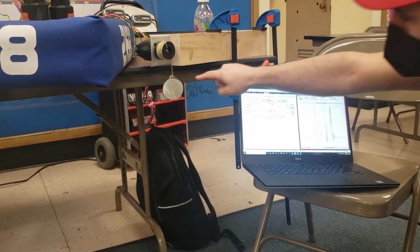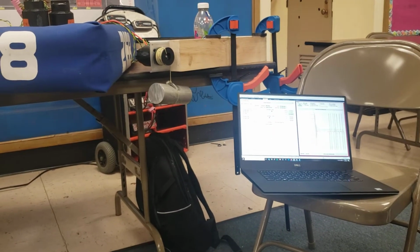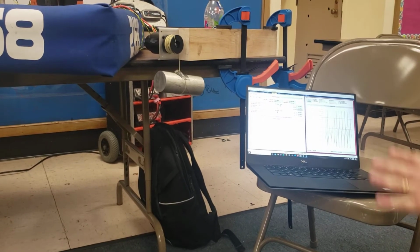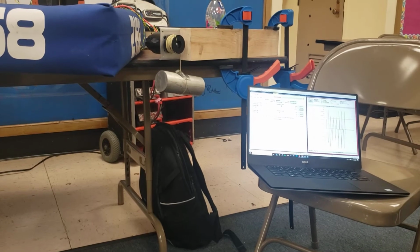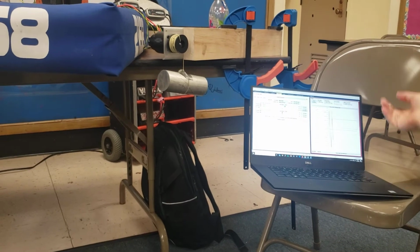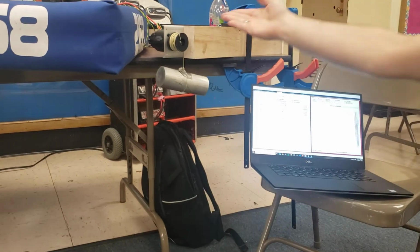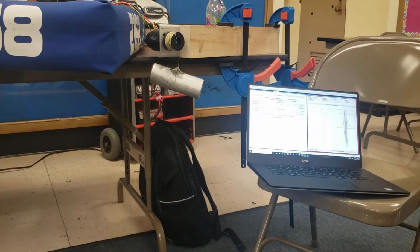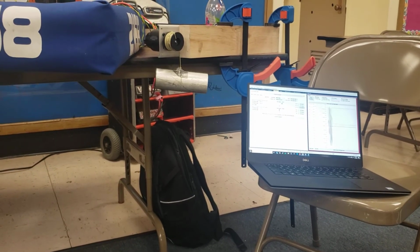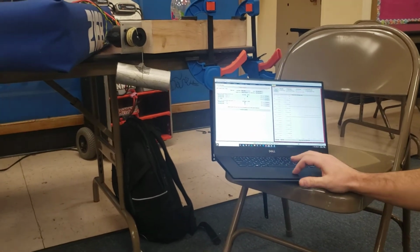Yeah, so this weight is between 2 and 5 pounds. It's chosen to mimic the weight of the lift. The load of a 150-pound robot is distributed across 2 Falcon 500s, and then goes through a gearbox, right? So divide that down, and you end up with about that much weight. So it's an effectively equivalent load on that motor. So a good demonstrational prototype, if you will.